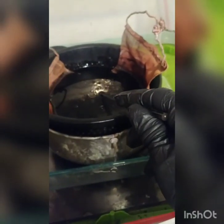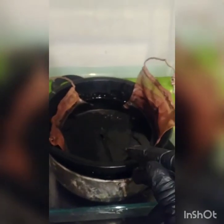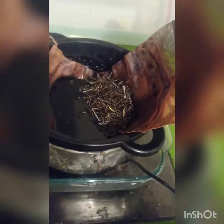Most of the time I run the cell with the fume hood door closed — you never know with sulfuric acid, it's nasty. You don't want to run your cell hot, because if you do, the sulfuric acid will start to attack the copper. These pins are all copper-based, and when your cell gets hot it will start eating up things you don't want. As you can see, there are still a couple of pins that aren't completely stripped.